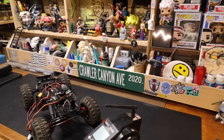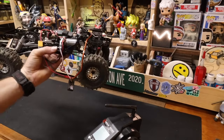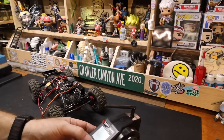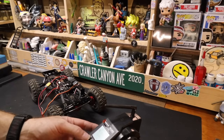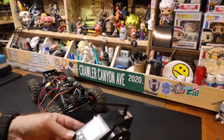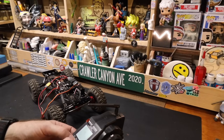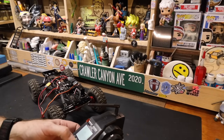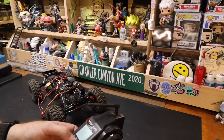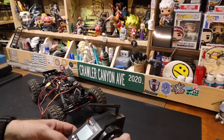And also, we measure torque at 1 inch. This horn, I think, is 35 to the outside because we want to clear all the stuff and we want to keep our links parallel. We'll do it this way. It's really easy. If you just double tap the buttons, you can see how much trim is taken out from the points of sub trim. But here's why I don't think it's going to be a big problem. We're just going to take both steering endpoints down to like 30%. Because we're running a horn that is so long, we are exchanging torque for clearance, and speed is going to come in because it's moving much further out at the end.